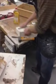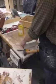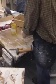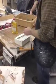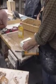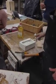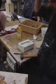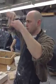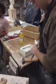Now, theoretically, we made this flat, so it should sit on a nice flat surface. You could put it on your board if you don't have a great surface, or you could put it on sandbags with cushions. If you have an uneven surface and you hit in the center with a chisel to break, that will snap your casting. So it's important that you don't do that.